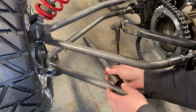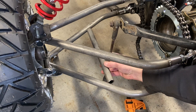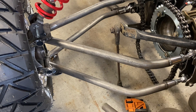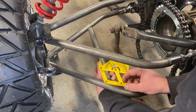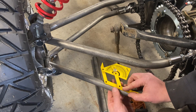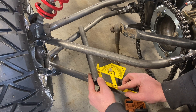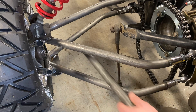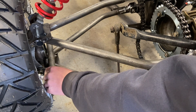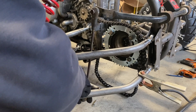Now we're going to move our attention out to the A-arms. We're going to put in this cross member for this to hook onto. I'm going to leave it long so I have a good place to square it up. It looks like we're just going to nibble off the edges with the hole saw. For your notches, here is a very inexpensive but invaluable tool — I use it a lot, especially when doing a 90-degree cross member. You can just line this up with your bar, set this parallel, and get your gauge reading. Looks like we are at 35 degrees. Whatever notch this is is going to be the same, so let's get it notched up and get it in place.